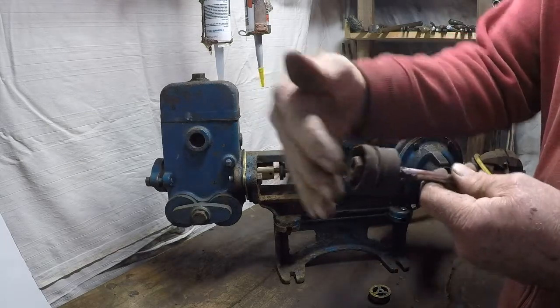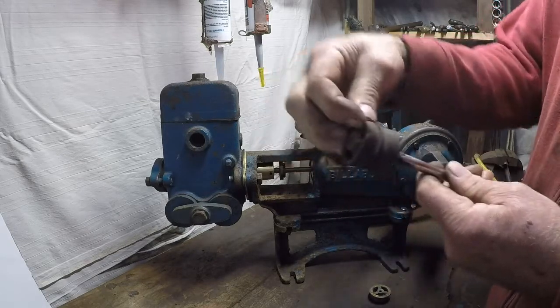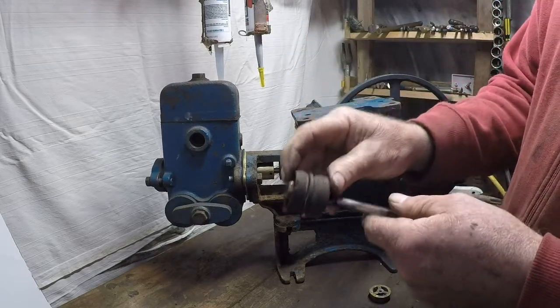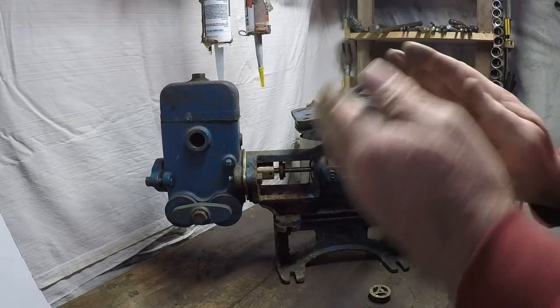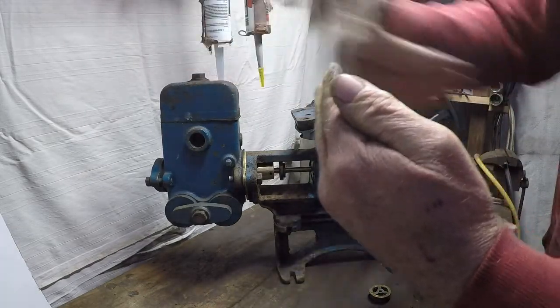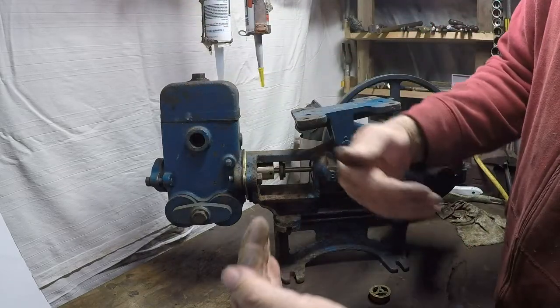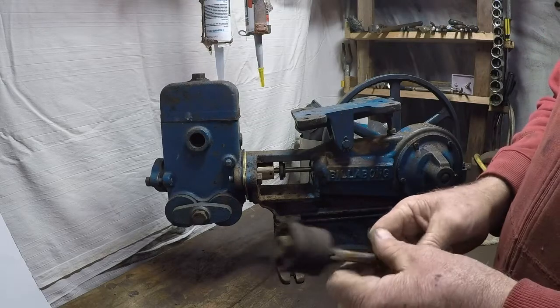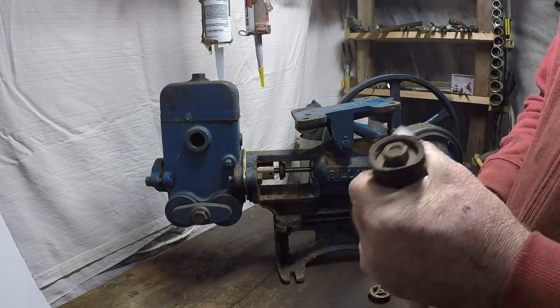and there's a lot of force when your pump is pushing, these leathers get pushed back really hard, and if that is missing, it sort of acts like a scissors. There's the bucket, there's nothing to hold it back, so it just shears off, and as soon as your buckets are sheared, that's it. You've wasted your good buckets.